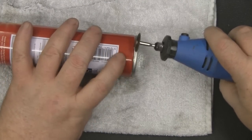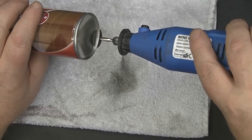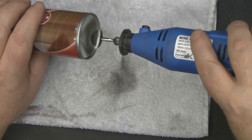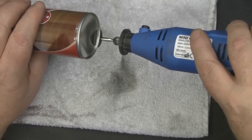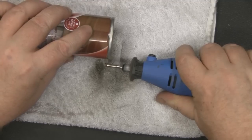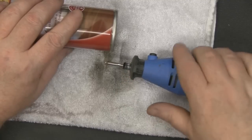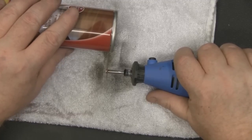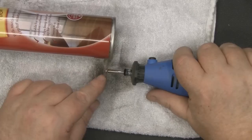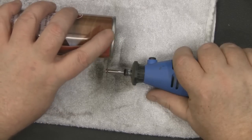I'm going around a few times to make the cut ridge a little bit deeper, using the wheel against that ridge at the base as a guide. Now I'm cutting all the way through to separate the base from the can and from the rim simultaneously. It's a lot safer and easier to hold the Dremel in a fixed position and move the can into it — you won't get the wheel jumping out as much, and you're less likely to snap the cutting wheels, which are fragile. You'll probably need at least two to cut the base away.